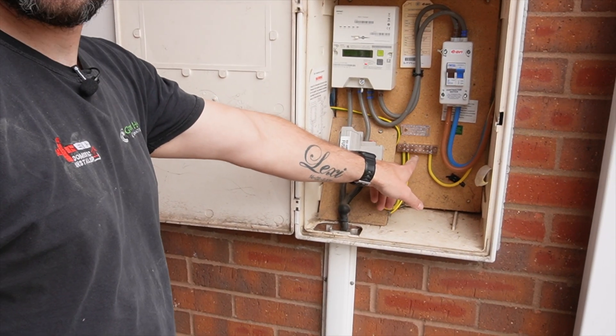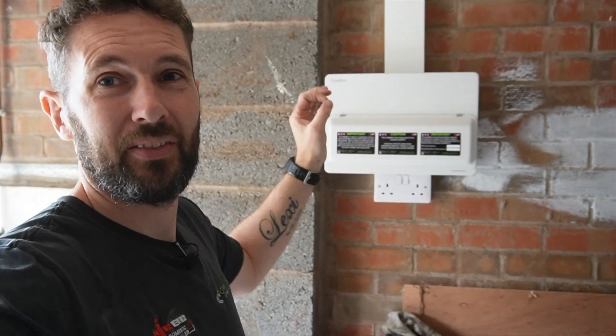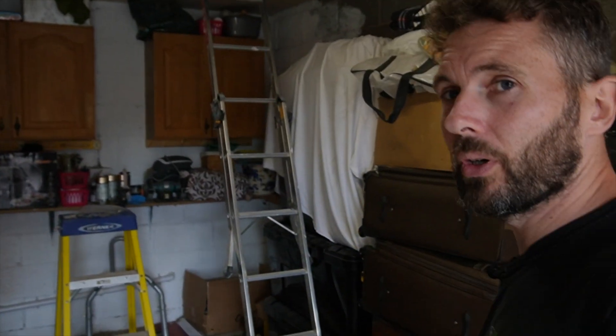MET's in, all labelled up, gas bonding's in. We've now energised the system to make sure that's all okay, we've turned the RCBO on, she is on. I've quickly blasted through the testing for this one circuit because I just want to make sure and do a functional test. And it's on - nice, done and dusted, plenty bright enough for this room, which is fantastic. Hopefully you've enjoyed this video - if you haven't subscribed, make sure you do, the link is in the bottom corner. Turn your notifications on, thank you very much for watching, catch you on the next one. Take it easy, look after yourselves.